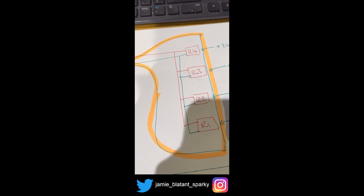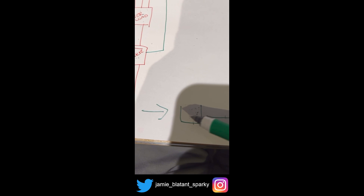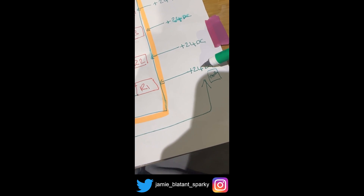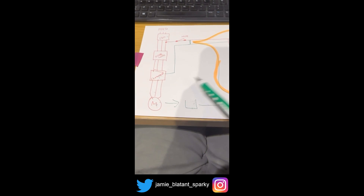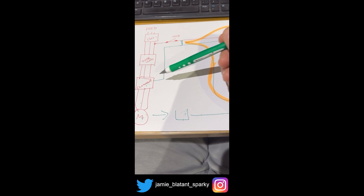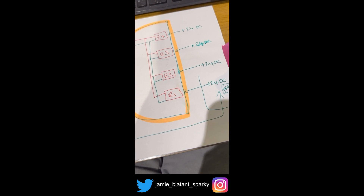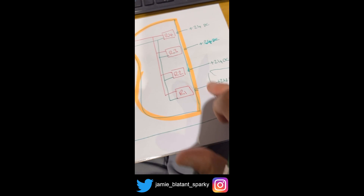The problem seems to be: if you apply 24 volts here, it tells this contactor to run, which runs this motor, which runs this pump, which sends oil to a tank. Now, if you engage that and the tank gets full, you need to stop it. So within this panel it's very simple — there's control to bring the mains on, but there's no tank control. That's because the tank control is taken care of in the engine via a PLC, which I'll now show you how that control functions.